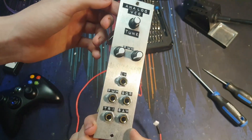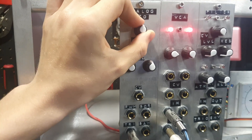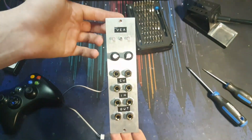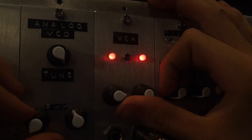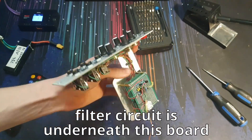I've also got three other modules — I won't talk too much about these since they're not my own design. The first is a VCO, or voltage controlled oscillator, which makes a waveform where the frequency depends on its CV input. Every one volt you send to it will raise the frequency by one octave; this one makes a triangle wave, a sawtooth wave, and a square wave. The second module is a VCA, or voltage controlled amplifier, which changes the volume of whatever you send through it based on its CV input — more CV signal makes a louder sound, less CV signal makes a quieter sound. I put RGB LEDs on this one to tell you where the CV signal is coming from, and if you have multiple CV sources it'll mix between colors. The third is a voltage controlled low-pass filter that cuts out any frequencies above a certain threshold you can set with CV, and it can also add resonance, which is basically an overshoot at that cutoff frequency.